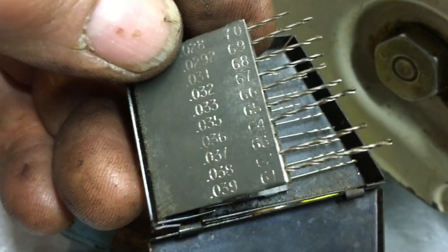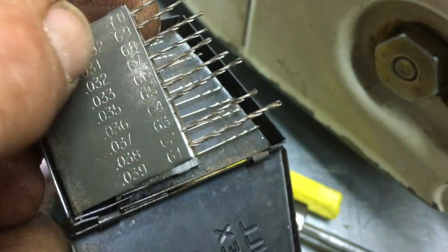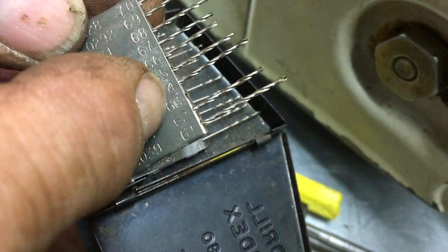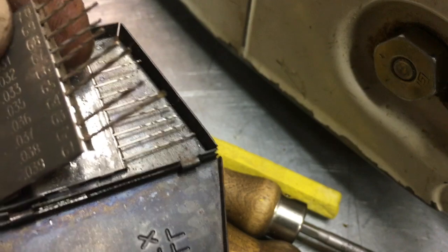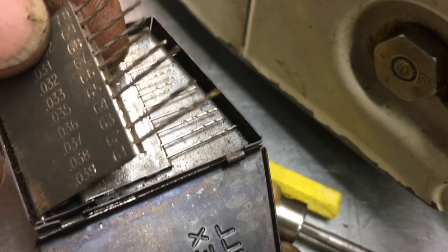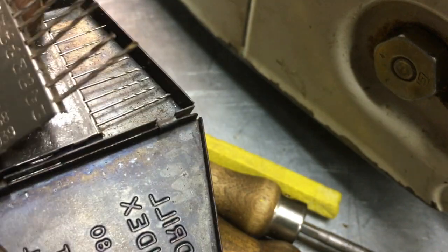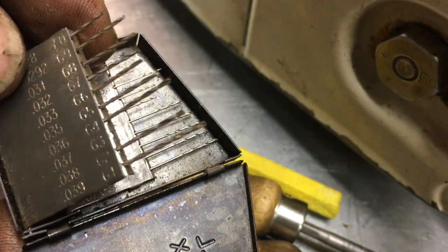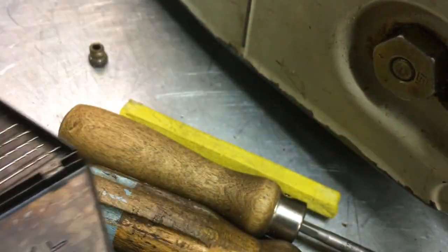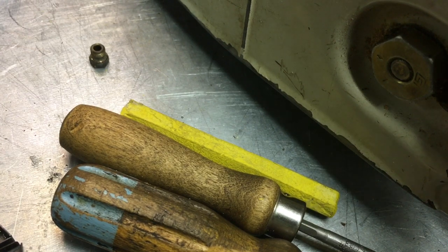One thing I forgot to clarify is that the sizes for the LP were actually number 63 and number 67. There were three that were going to be 67, and then the sear burner is several sizes larger at number 63. You remember the physical size of those larger orifices — whenever we checked to see what the bore was, we could figure out what the BTU capacity of the burners were. That was for the natural gas. LP, like I said, is approximately three times higher pressure, resulting in a much smaller orifice for the same BTU capacity. I forgot to clarify that before, so that's why I'm using the pin vise and all that in the drill press. Just a little addendum. Tractor Man 44, out again.